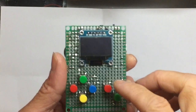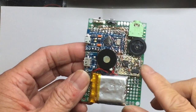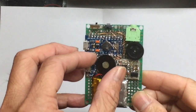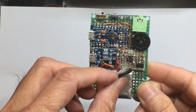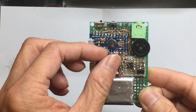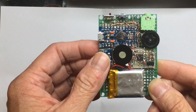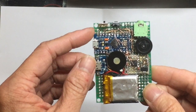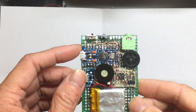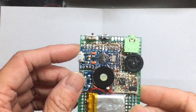Hello there. I just want to show you this Arduino Boy clone that I created using the ATmega32U4 chip — that's the one on the top. On the left we have the 5-volt regulator module which also charges the lithium battery, 3.7 volts 300 mAh, at the bottom. On the right we have the flash card that stores 100 games in a 4-megabyte flash RAM.